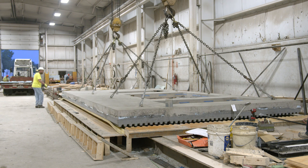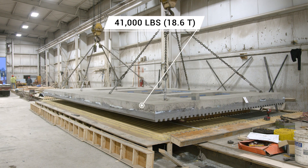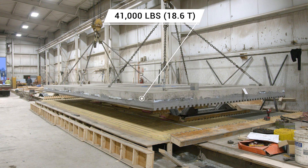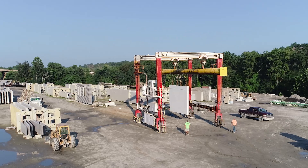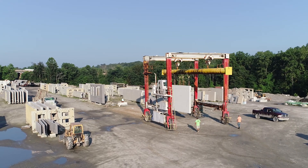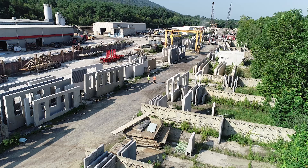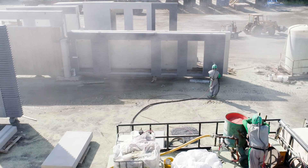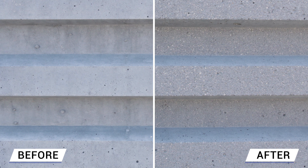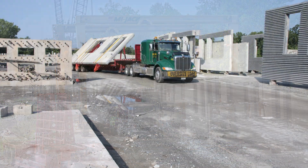The next day, with the help of two industrial overhead cranes, the 41,000-pound casting is carefully lifted away from the forms. The VitaFlex 60 form liners are separated from the panel and the panel is moved to a truck and taken out of the building. Once off the truck, the panels are placed in the Slough Precast holding yard — a massive staging area for all concrete panels while they reach full cure. To create a uniform surface finish, the panels are sandblasted, a process that removes a fine layer of concrete from the casting, exposing the sand and aggregate within the mix. Once fully cured and processed, the insulated panels are ready to be transported and erected at the job site in Staten Island, New York.